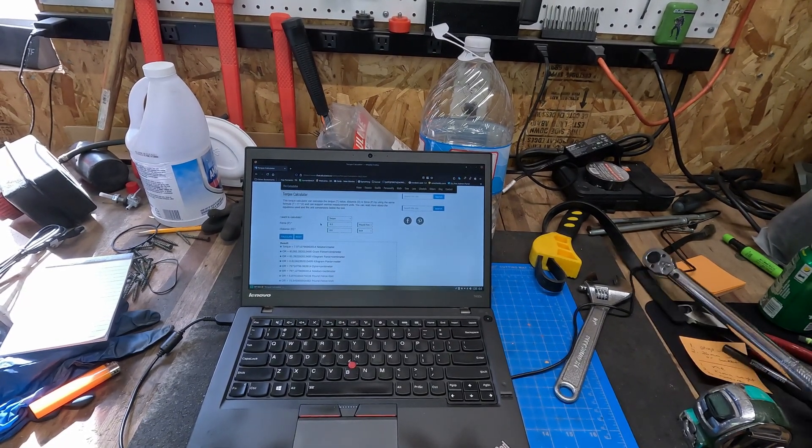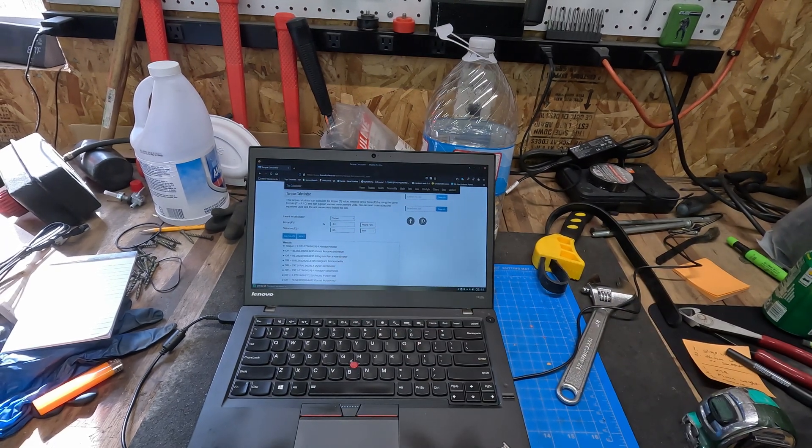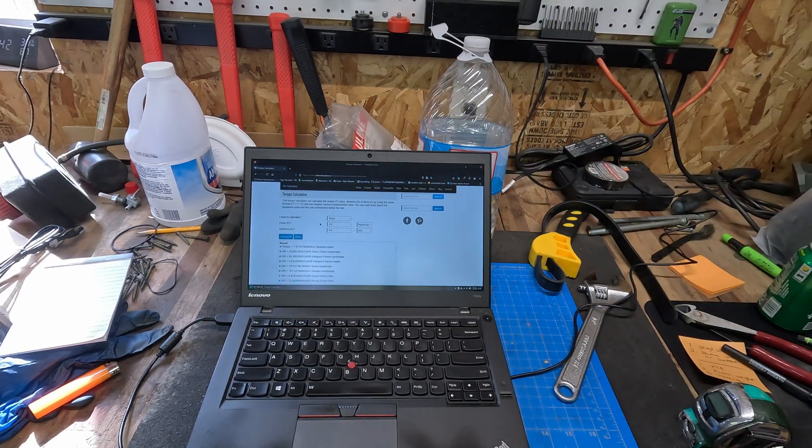That's it — that's how you calibrate these Pittsburgh Harbor Freight torque wrenches. Give it a try and test them up against a digital scale afterwards to see how close they are. This is my preferred method because torque is weight times distance applied on the end of a stick, and it's 100% accurate to calibrate them this way. How accurate is a digital torque wrench? Plus or minus four percent usually. Are you going to calibrate to plus or minus four percent, or to the exact force and distance? Let me know in the comments — thank you for watching, y'all have a nice day.